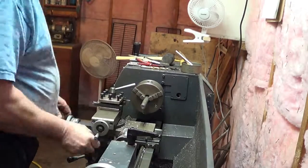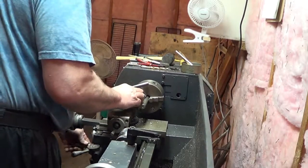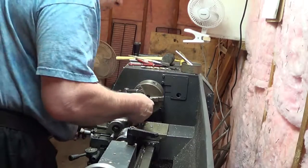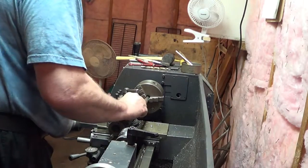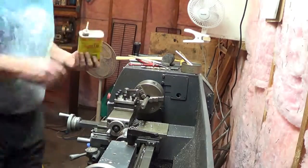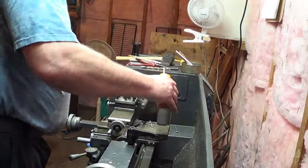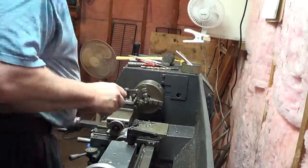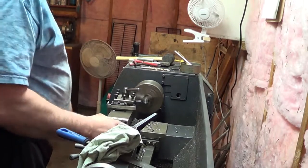These will have a handle welded on, and then a hole drilled for the tap size for 3/8 all thread, and then re-drilled again for a clearance hole so that only a half-inch at the bottom will be threaded. You didn't think I wanted to thread the entire thing, did you? Not me.